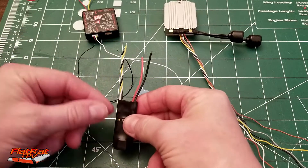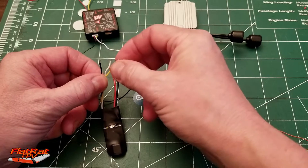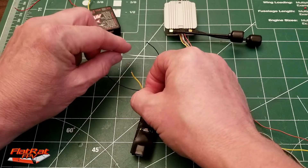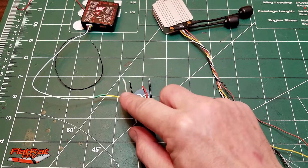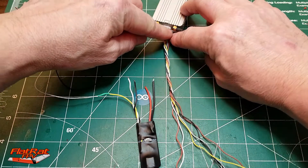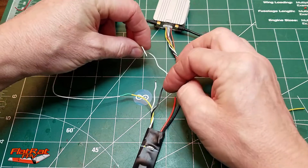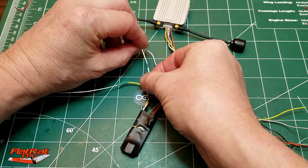On our unit, this is how it comes — these are the pigtails that you have. For this particular one, you're going to be using the yellow wire. Yellow is receiving from the micro vector to our Arduino. We're going to get those soldered together. Now, focusing on our air unit for a couple seconds — what we want to look at is the white wire coming off your harness. That's going to be the receive wire. We're going to take those and solder them together as well.